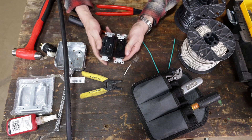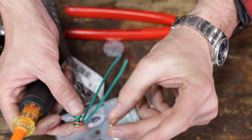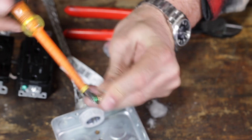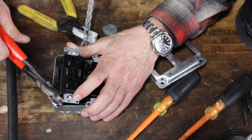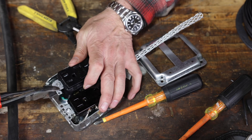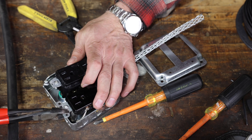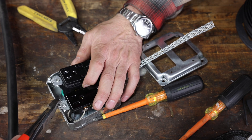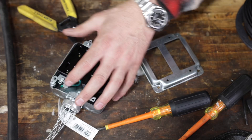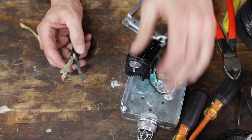Now our plug is almost half made up — white to silver, black to gold. There are cleaner ways to do this with copper ferrules and two-into-one connectors, but as a professional homeowner we don't always go by the book. Also note these little wings on the outlets — in metal box applications there's a cut in there and they're designed to be bent and snapped off. My granddad actually saved these and used them as washers — taking frugality to a whole new level.